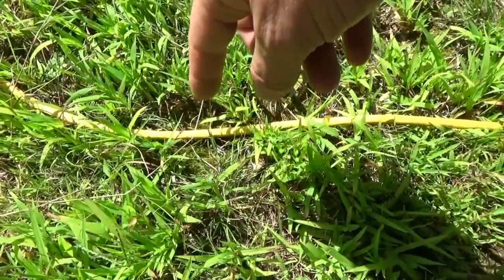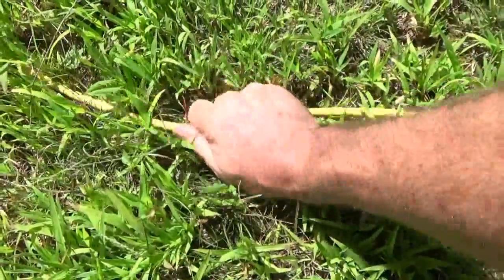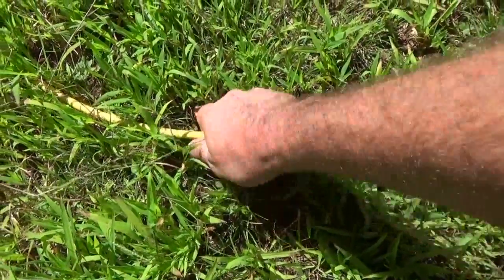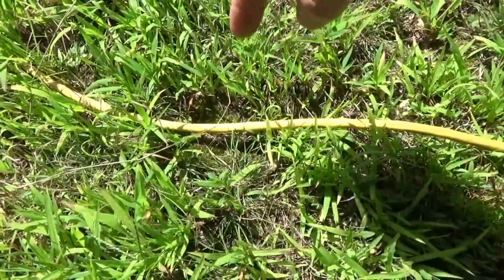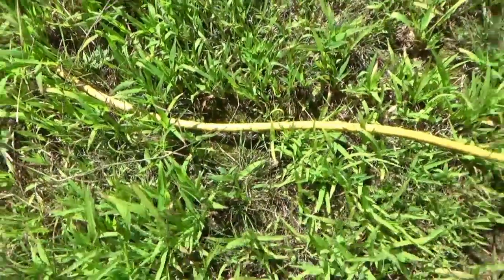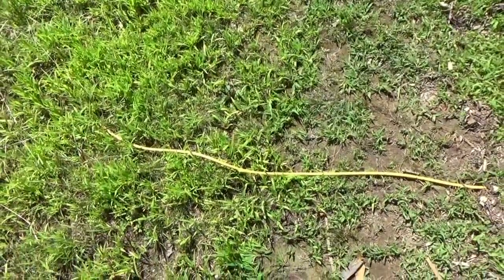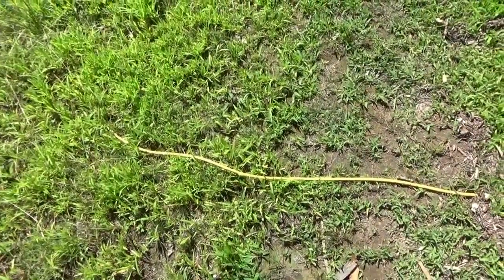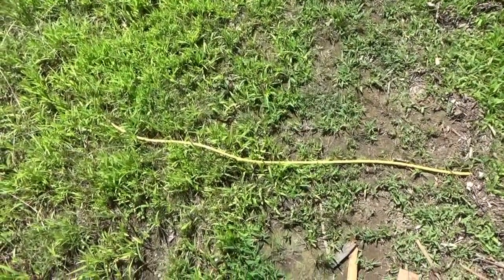I knew it wouldn't be good with the lower voltages that I'm using now, and this definitely confirms it — this is really hot, it's all wasted energy. I'm very happy I decided not to hook up three panels, or I would have burnt this wire and had nothing. So only 200 watts of power coming in through those wires right now; the rest — 270 watts — is burnt off as heat energy.